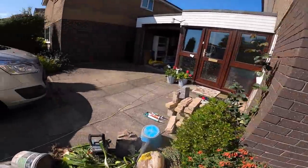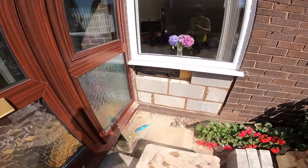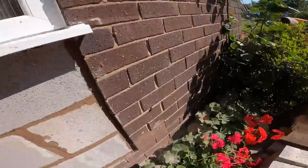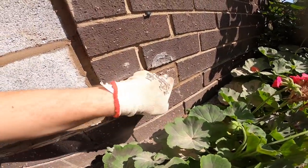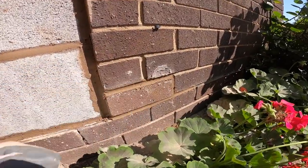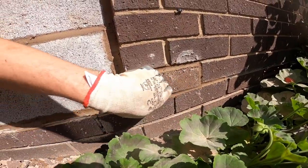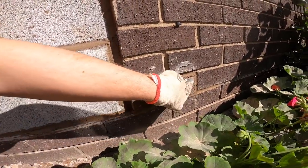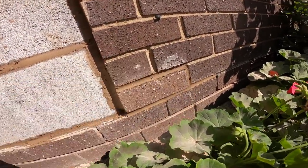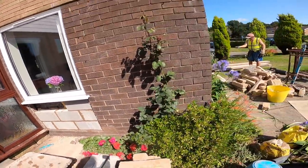Oh, yeah. And just real quick on my side as well, besides the wall, there was also a blown brick here, so I've just knocked that out, toothed it in, top pointed the mortar and jointed it up. So just a bit of a neater looking brick instead of the big hole there was in the other one. It's a little thing, but you know, every little bit.